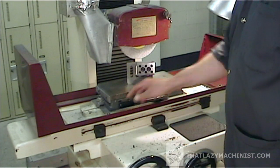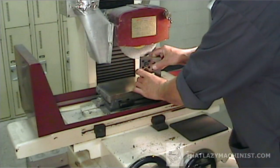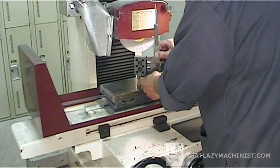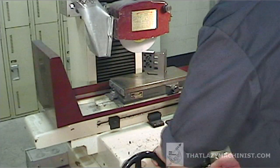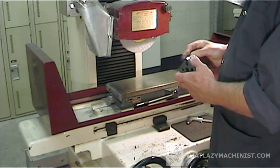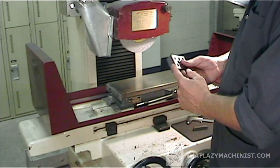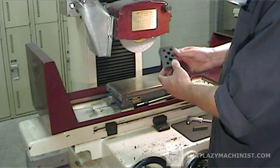Patience is a virtue, and here for safety it's important. So once everything has stopped turning, I can remove my angle plate, clean everything up, and reinstall it so that my tertiary surface is pointing upwards towards my grinding wheel. I can now redo all the steps I went through to obtain my secondary reference surface, but this time for our tertiary surface. The main difference is that we're shooting for 75 millimeters — that's 75 millimeters after both surfaces have been ground, so just take half off of this first surface. If we want our holes to be in the proper position, it's very important to remember which surfaces were my reference surfaces. In my case, the two surfaces closest to my identification number are my reference surfaces.